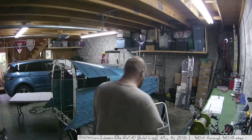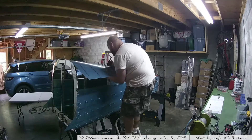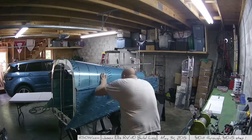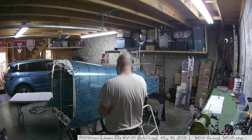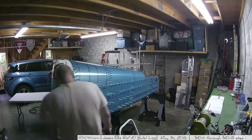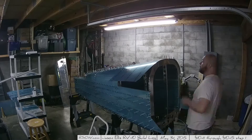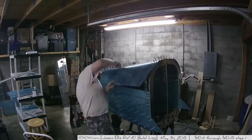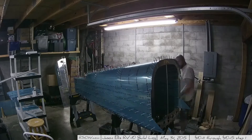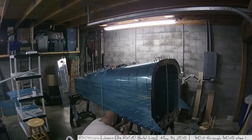I go back and forth between the pneumatic drill and the Dewalt, probably until the Dewalt dies. Here I'm working on putting the forward skin on — remember, you're not going to do any dimpling or work on the 1006 front rib yet; that comes much later. Just get everything in place. More harvesting of clecos from the underside, then we go to the other side and get that skin laying down flat. Really gives you a sense of scale — this is like the back one-third of the plane.